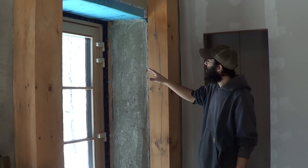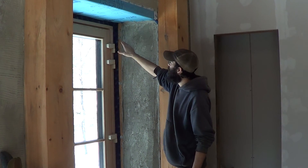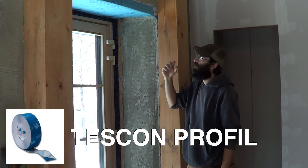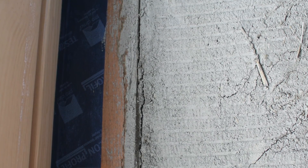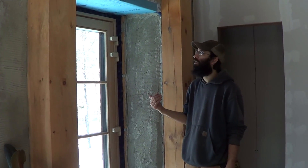Here the transition was very similar to the windows we were looking at earlier. The doors are installed using steel fitting straps screwed to the frame and air-sealed with the Tescon Profile, which was pretty handy — it was nice to have the different sets of release paper to get a really crisp line that didn't intrude on the frame of the door.